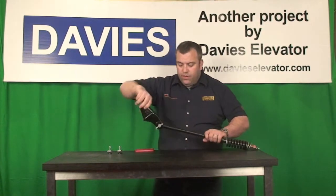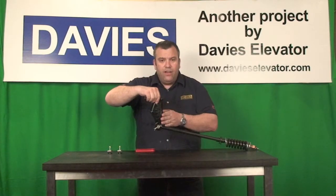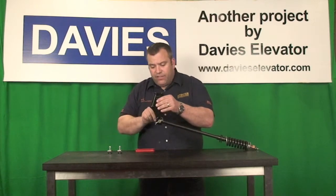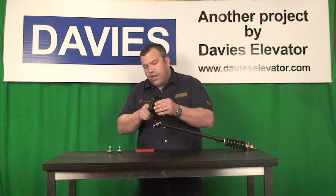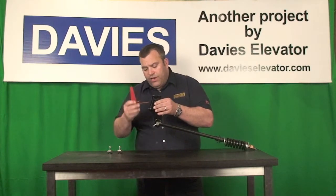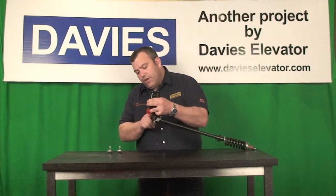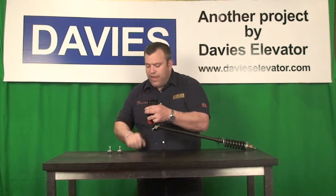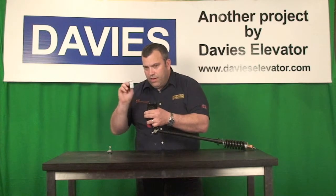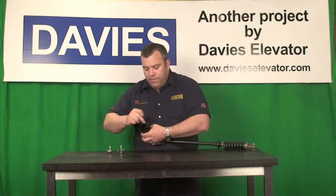Here's how it works. Take your wedge and socket assembly, pass your rope through — it comes through the flat end of the socket. It passes through, comes around, and the tail end or the dead end passes back through the chamfered side of the socket. The wedge gets inserted at the same time the rope gets taken up. The rope passes underneath this wedge, back through, and then pops out on the outer side of the socket assembly. After you've got all that together, pull your ropes and tap the sides with a hammer to set the wedge perfectly into the socket.